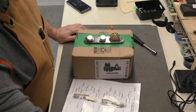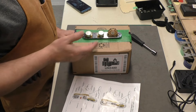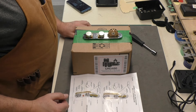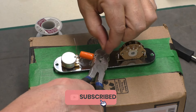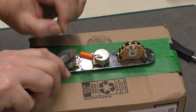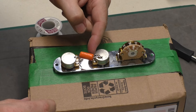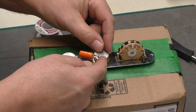I don't need any fancy tools, and I've got my diagram right here beside me. My switch and pots are oriented exactly the same way as the diagram, so that should help mitigate any mistakes. The first thing I've done is put the capacitor in — this is a 0.022 orange drop capacitor — attached to the middle lug of the tone pot, through the third lug on the volume pot, and to the back of the pot itself.